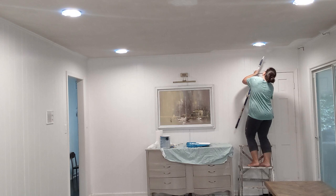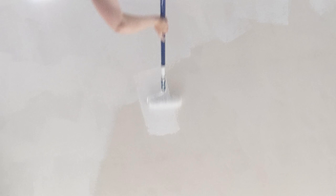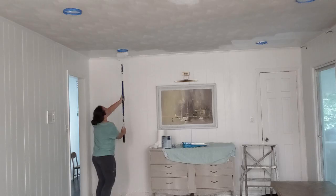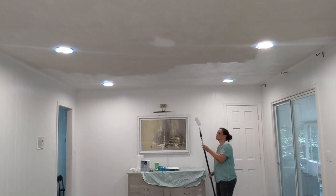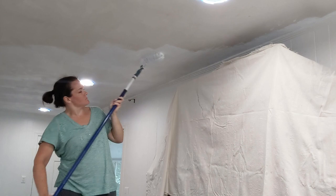The good news is rolling the paint onto your ceiling goes much faster and is much easier than cutting in around the edges. You may have heard that when you are rolling paint onto a wall or a ceiling, you should try to move your roller in a W pattern. The main point of that is just that you don't want to be going back and forth over the same section over and over, and you do want the sections where you're rolling on the paint to slightly overlap. When you're painting a ceiling, doing a literal W isn't always the easiest because you're working overhead, so just make sure you're overlapping your paint strokes and keeping the roller moving. If you start to feel like you really need to press down on the roller to get the paint to transfer, that just means it's time to get more paint — pressing down firmly will lead to lots of tiny little paint drips splattering down onto everything in your room.